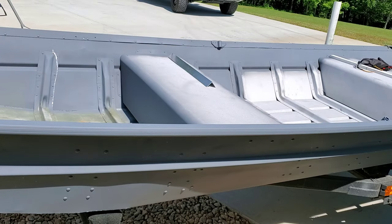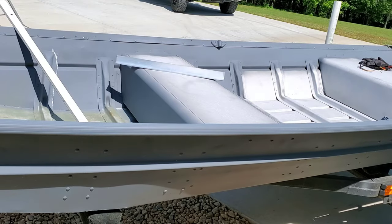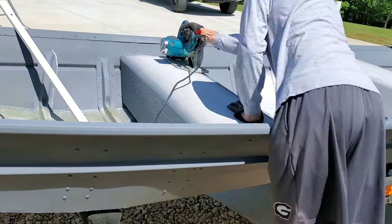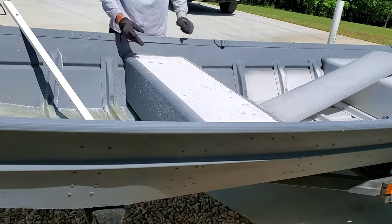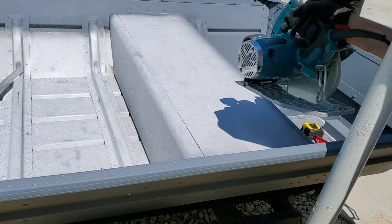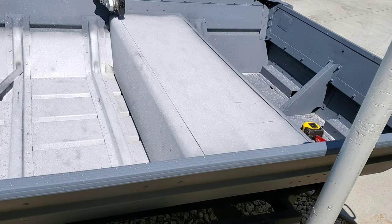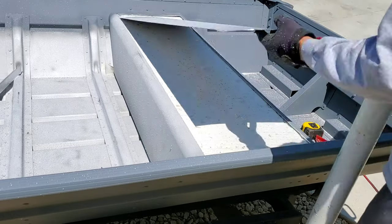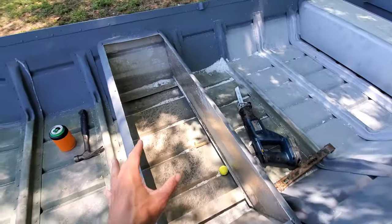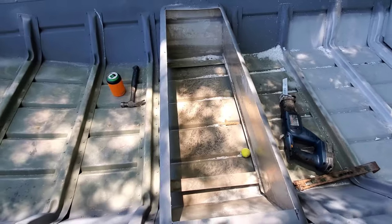On the tops of these benches I take inch-and-a-half by inch-and-a-half angled aluminum and use that as a scribe to mark out an inch and a half in on the bench top. Once I get it laid out I cut it out with a circular saw - nothing crazy here. It's literally an old beat-up wood framing blade but it still cuts aluminum really nicely. Come back in with an angle grinder with a cutoff wheel to connect the corners, then pop the top - that's it, real simple. I've found that to be the best way to do it; I've tried a lot of different things and a circular saw seems to be key.